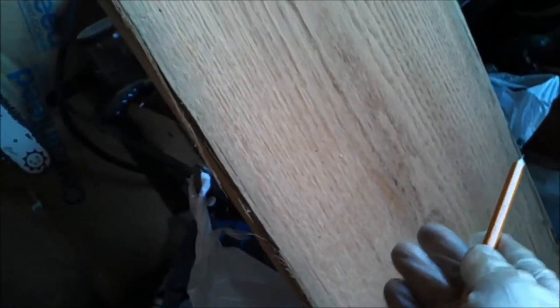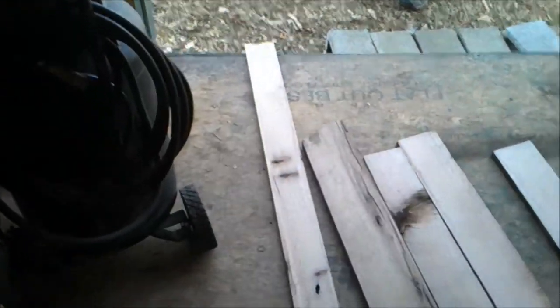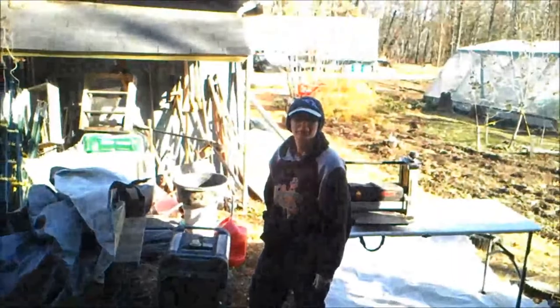Normally I like to run the whole board, but there's a pretty good split right here — a checking here and here down to this knot, which means the upper piece is not going to serve us. I can get something out here and here, but the upper piece isn't going to serve as a wide board. I measured from this knot down to this knot and got more than 20 inches — about 22 inches. So that one piece right there should make both of these. I'm going to plane the majority of this up so that if something happens I've got a little bit more material than I need. I will be building two of these — one for myself and one for a friend.